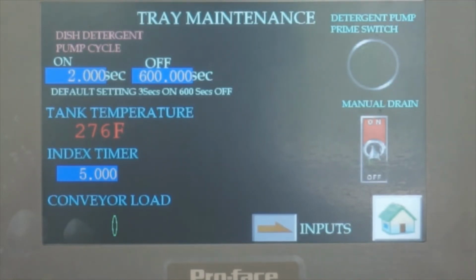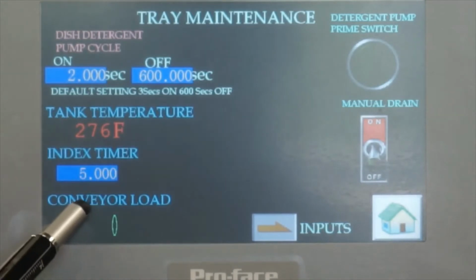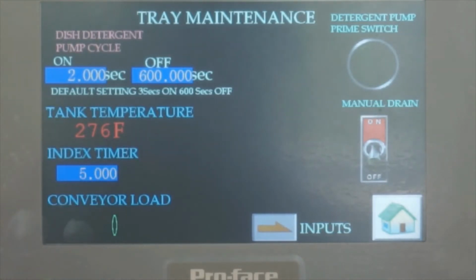More than that means somewhere the conveyor is not right, something like a bearing wearing out, or something else is going on. So it is strictly for maintenance people. Sometimes the conveyor stops, and they say it was running 5 minutes and then stopped. Then we could go and check the load, because with a high load it will run a couple of minutes and then it will stop, right?